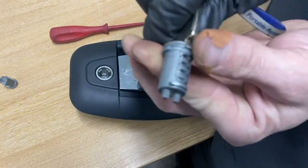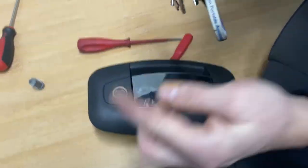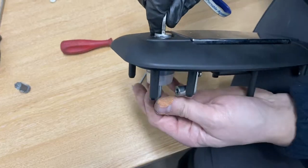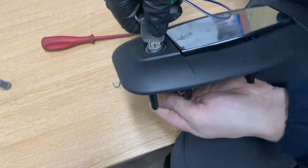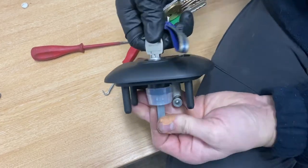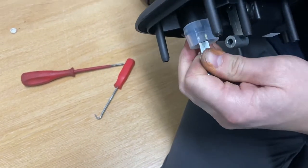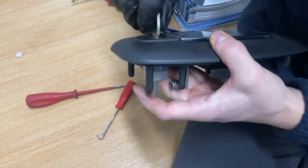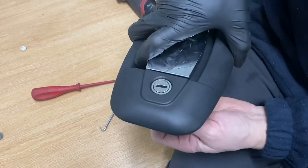All the pins are pushed in apart from that bottom one. Then you've got to line up the two tangs with that piece at the bottom. Sometimes I can do this straight away, sometimes it takes a few attempts. If it doesn't seem to fit in nice and smooth straight away, don't force it — it will come back out. You might have to twist. There we go — it's gone in. I just wiggled the barrel a few times and it's gone in, so the locating pin has got it now.